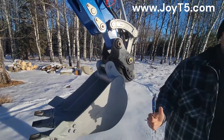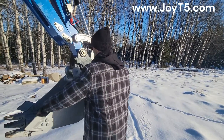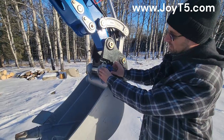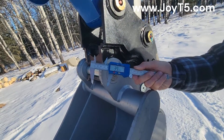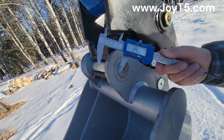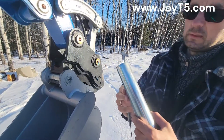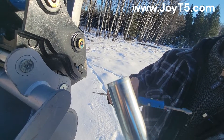Now if you don't have a spare pin and you want to measure it on your machine, you can try to measure here — as we can see the pin is sticking out — but you got to be careful because it's showing 39.3 millimeters. The reason for it is that you have a bit of a cone on this side, and on this pin you can kind of see the cone. So you got to be careful, we want the distance over here, not on the tip.